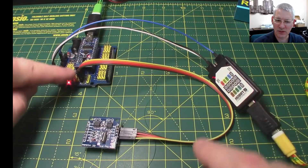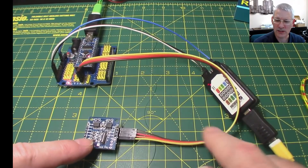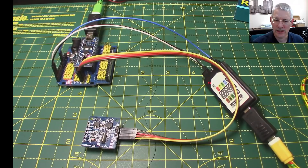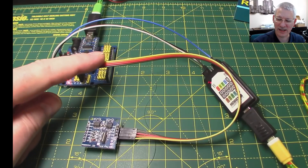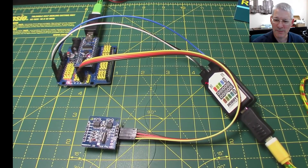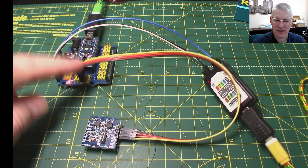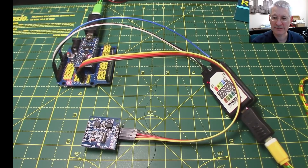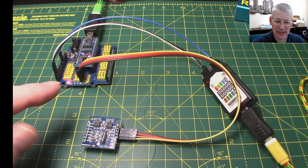The communication between the Arduino and the clock module down the orange and yellow wires is the I2C bus. The I2C bus sounds technical, but it's an agreed-upon protocol where electronic devices can make sense of and interpret the pulses coming down the wire - that's all it is. There's a series of precisely timed pulses, and because of that precision, devices can all make sense of it. You can hang multiple items off just two wires, which is why I2C is so great.